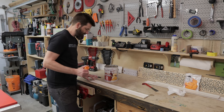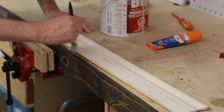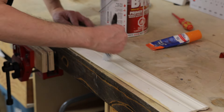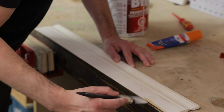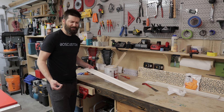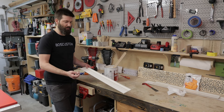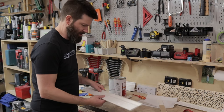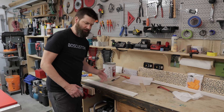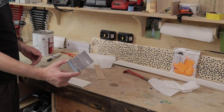While we're priming, we'll also go ahead and fill the nail holes — this is just some white wood filler. We'll quickly let that dry. It takes about 30 minutes, but I'm putting it by the heat register so it'll probably be done in about 10. That's all dried up — it took about 15 minutes. In between coats of primer, the best thing to sand this down with is a nice little sanding sponge.